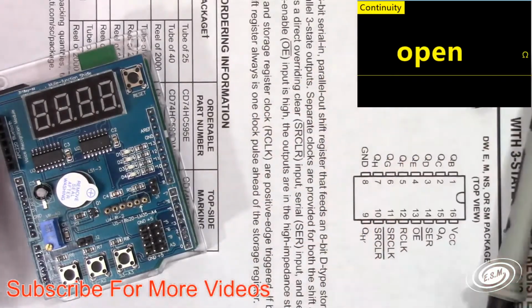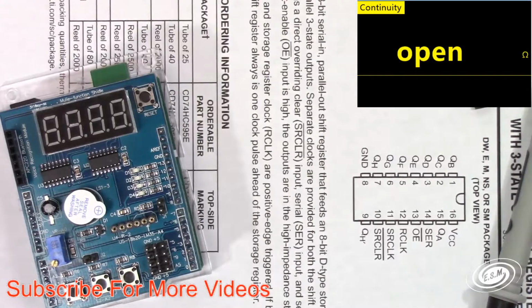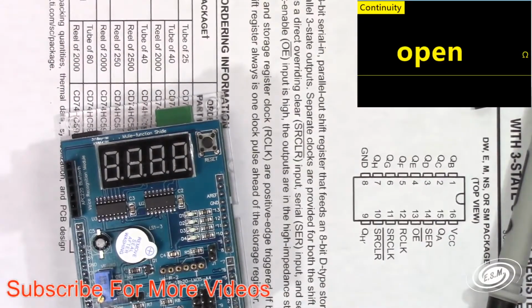So let's just do this. Let's do the U4-IR-2. We're not sure what that is. And that has 3 circles. This is pin 2. This was G and D, and this one was plus 5 volts. So ground, plus. So I drew that on here. This is pin 2, this section here. I'm going to draw this other section here that I don't know what this is. 3 pins there. So we do know that the middle pin is A4.